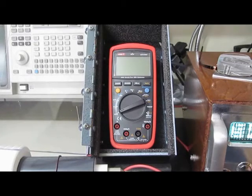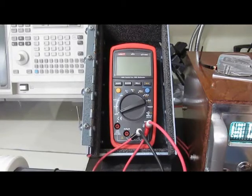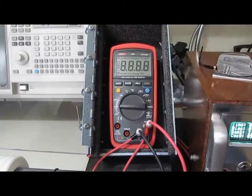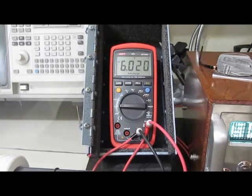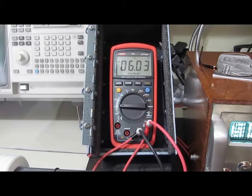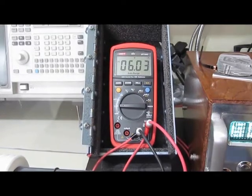But anyway, I suspect the 4 kV on this one must be inside of the margin of what the meter could have handled. So this will be a 5,000 volt transient, and I'm not going to be too surprised if this damages the meter. Okay, here we go. Here the LeCroy scope. Of course, I just saw another transient.